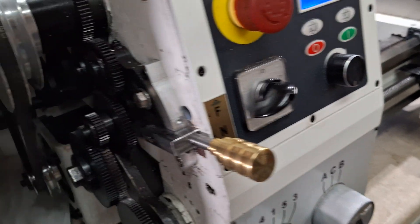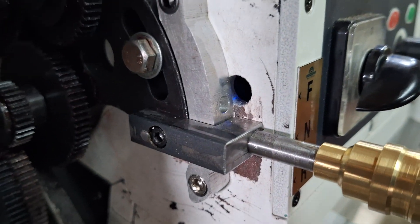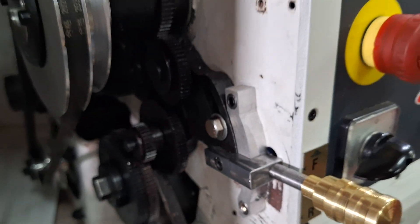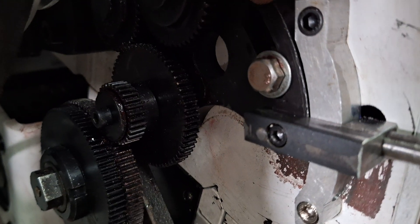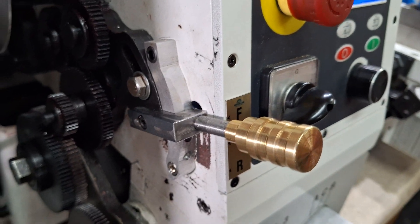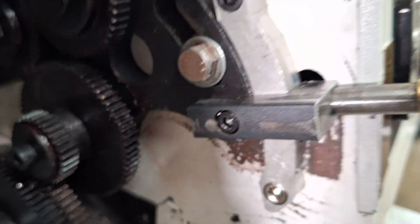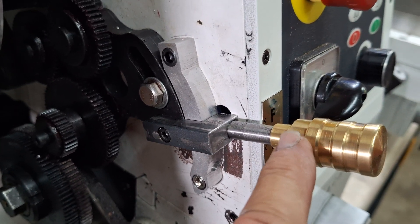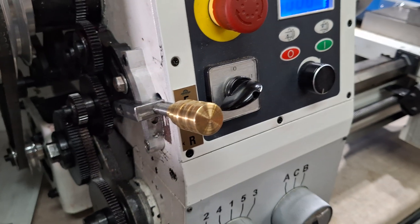So I came up with this. Like I said, South Bend can do it, I can do it. And you can see the detenting system. I've got an aluminum strap bar right there — it's just a little narrower than this piece behind it that glides. Sometimes you've got to move the chuck a little bit to get the teeth to mesh. I flat-stoned the whole back of this plate right here — it was pretty smooth, but flat-stoning it made it all the more smooth and took out any little burrs. So it glides really, really easily. I used my pin gauge to capture that contour, and it captured it real well. That was the hardest thing for me to figure out — capturing that spring in there. I've got a detailed video of how I did everything, and we made the cutout on the door to match the throw.